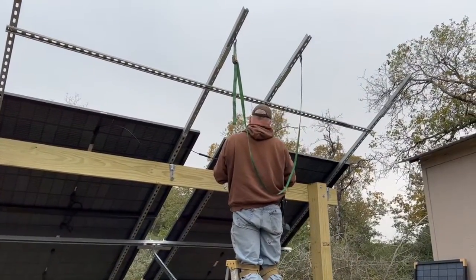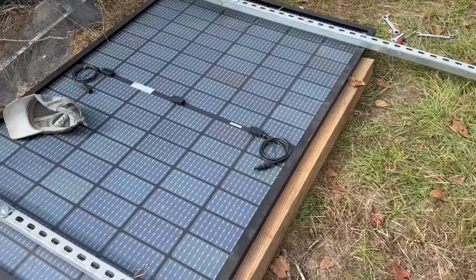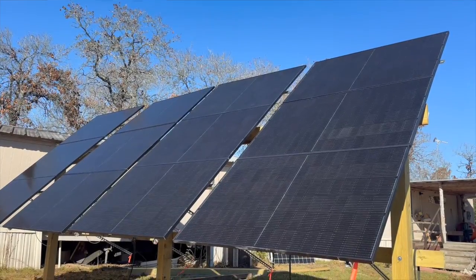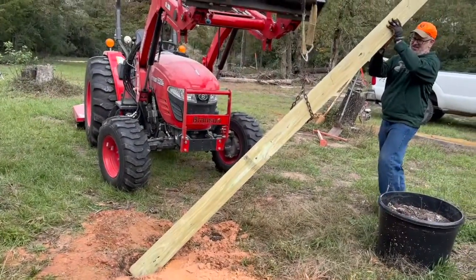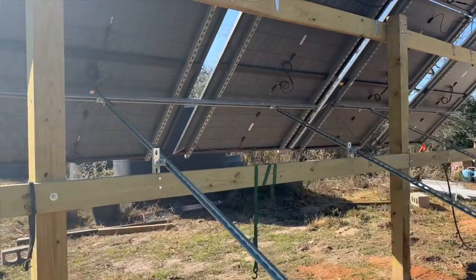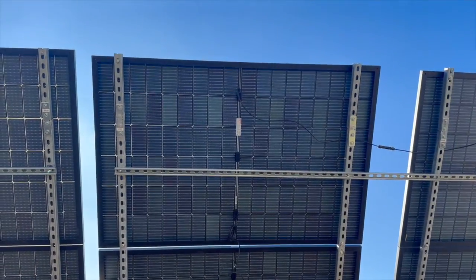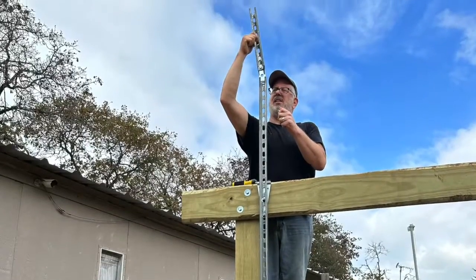This was kind of an experiment in progress. We were able to get these panels up and running, and they're doing pretty good. I'm pretty happy with the power for being in the middle of December — we're getting probably 80% to 85% power. The way we mounted these was we took 6x6 heavy timbers and sunk them into the ground about 5 feet with concrete, then came back around with the unistrut. We used 12 and 14 gauge unistrut in a different method. Three of the panels are a little bit more than 10 feet, so we just spliced on the end there, as you can see.